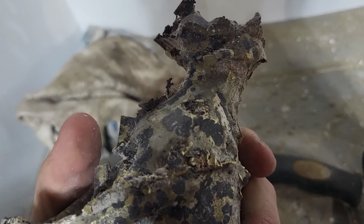And I think this is for many reasons. Reason number one, a lot of flashing. I think that was because my sand plaster mixture had too much water in it. And so when it's super liquidy like that, the water will eventually have to evaporate. And as it evaporates, it's going to expand a little bit, and it might potentially crack just from that alone. But also, when the water leaves, there's going to be less of the sand plaster mixture since it's more liquidy. And I think without that extra strength from the sand and plaster, it also leads to cracking when it's actually poured. Number two, the brass was very dirty.